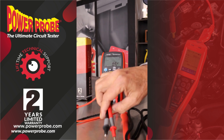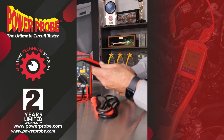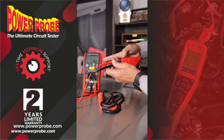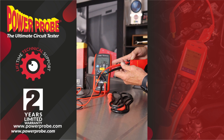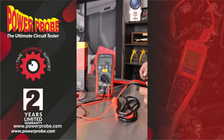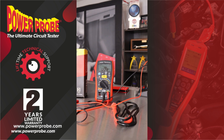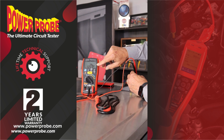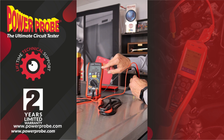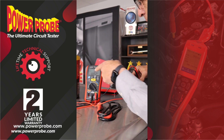Starting off with just the voltmeter mode, it has what's called auto detect AC/DC. We'll plug in this battery first — you see it automatically switched over to DC mode. There's that auto sense button. Let's plug in this socket here — notice it automatically switched to AC mode, and it displays not only the voltage but the frequency if it's an AC signal. So dual display, bar graph at the top.